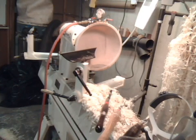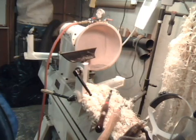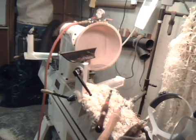Yeah, Argonaut, I have messed around with denatured alcohol. Jury's still out whether it works really well or not. I haven't seemed to have lost any pieces. I still turn to 10% thickness, even if I'm going to soak them in alcohol. Depending on the size, I may soak them for a day or 2 days or 3 days, or sometimes they end up being in there for a couple of weeks if I forget about them.